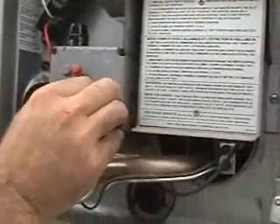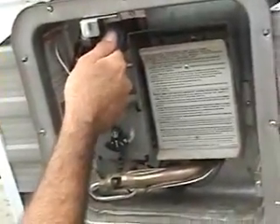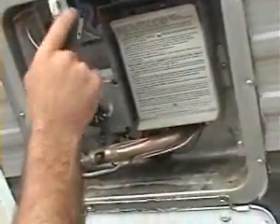You never want to have that on unless you have water in there. Always have water in there. The best way to know you have water in there is with your pump running. You're always going to have water here unless you drain it for the winter. When you do that, come out here, pull this pop-off valve open and leave it open. Hook it to water until you actually see water coming out this pop-off, then close it off and you know it's full of water.